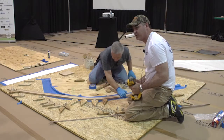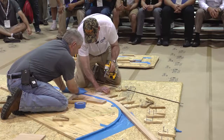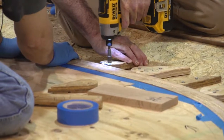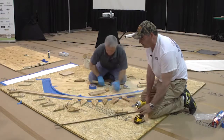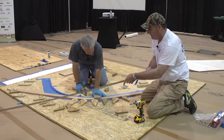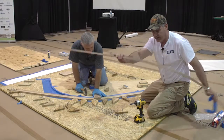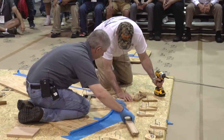You can extend these out if you're working by yourself so you can push them with your knee. These are basic cams that can be made at just about any length you want. Sometimes, what we do is the first piece — the test piece — to see how thin or thick we can make it. We want it thicker if we can, and we do a dry piece to see if it'll break. If it starts to break a little bit, sometimes we'll wet these down. Some people steam them, but we just wet them a little bit, mist them, put the glue on, and it should go. Eventually this could make a pretty tight curve. Different wood species are a little easier or better than others, so you're just going to have to work it out.